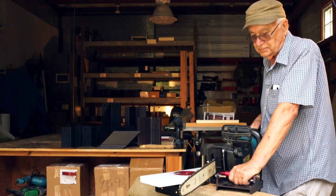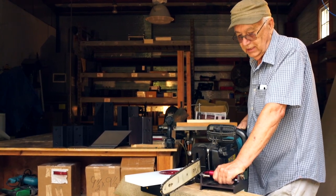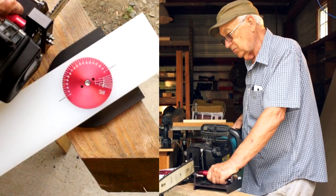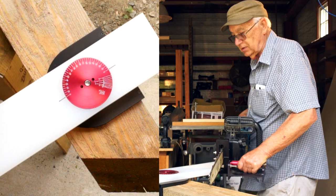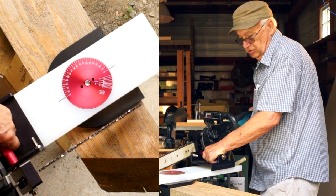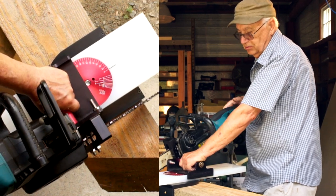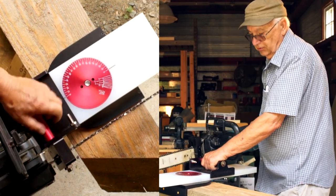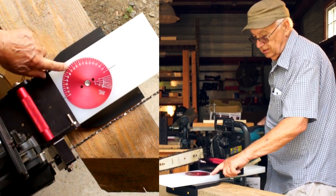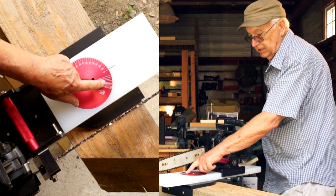One of the things that happened after we developed the T-Rex was we realized that we needed special tooling. One of the things we've developed is this rotary table and chainsaw guide — this makes your chainsaw simply slide on this rail and you can square cut your beams. If you notice this dial, we've got all the angles in degrees and we also have the roof pitch.